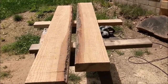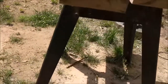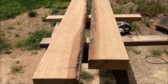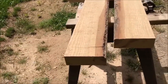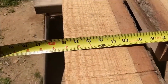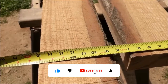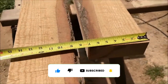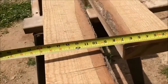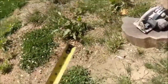Here are the pieces, all dusted off and reoriented so that the two bark sides face each other. What I want to do is lay these pieces out so we get a pleasing air gap between the boards and end up with a uniform width across the length of the tabletop. Right now the two boards, outside to outside, come to about 15 inches. I think I want it to finish out at 16, so I'll orient these boards roughly to 16 inches apart, outside edge to outside edge.